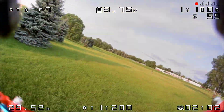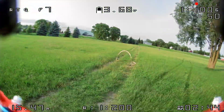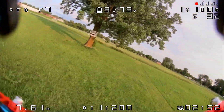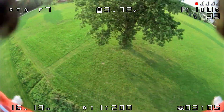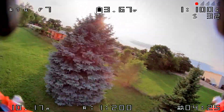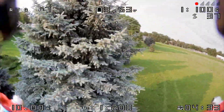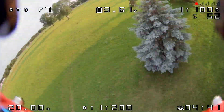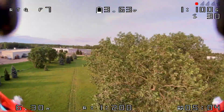This isn't specific to this camera, more about SharkByte in general. This system has very, very good motion clarity. As you're moving past things, there's no time-based compression occurring where frames get blurred together. Every image is very independent from the last, making for a very sharp-looking image without artifacts from prior frames. I really like the way it looks. The frame rate is locked in, perfectly smooth, and never a dropped frame. On the downside, you can sometimes see some image loss — that's just how SharkByte works. Do we want missing information from the frame and maintain a high frame rate, or do we want to drop frames and retransmit? I like to have very consistent video frames.